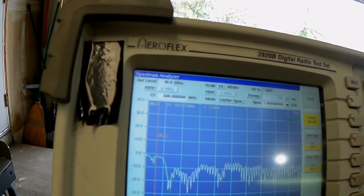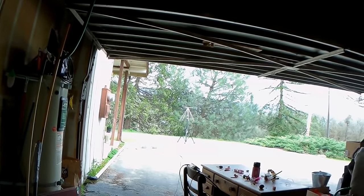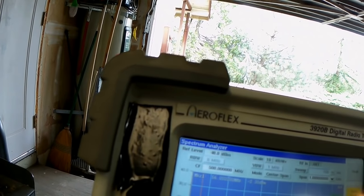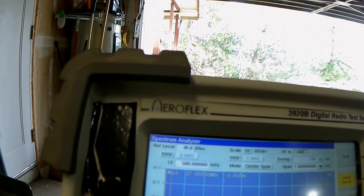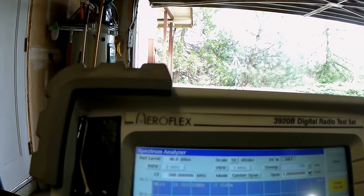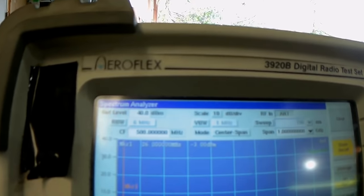As far as the rest of it, there's hardly any change whatsoever - it's almost a carbon copy. Adding a little bit of length on that whip is not going to affect anything from 150 megahertz on out, but it does affect the low band 50 megahertz range. As for CB - 26, 27, 28 megahertz - you won't be able to transmit too well, you might damage your radio, but you will be able to listen to it. I've listened to CB radio from as far as Tennessee at my location - a good skip hop, probably using a linear amplifier, but still.